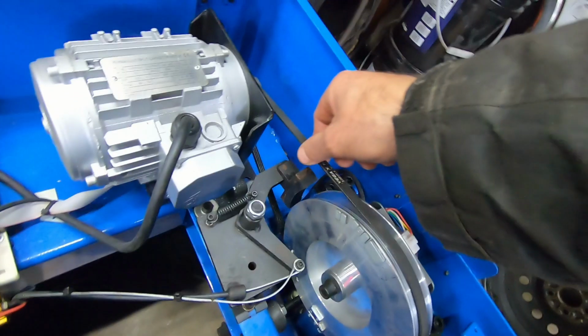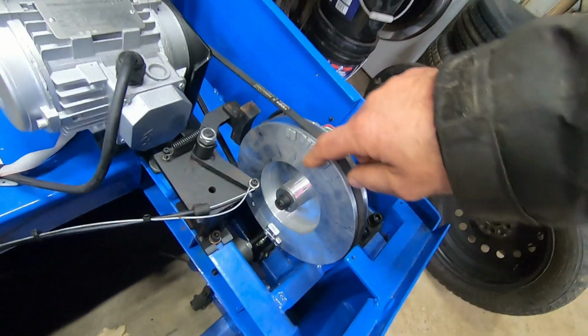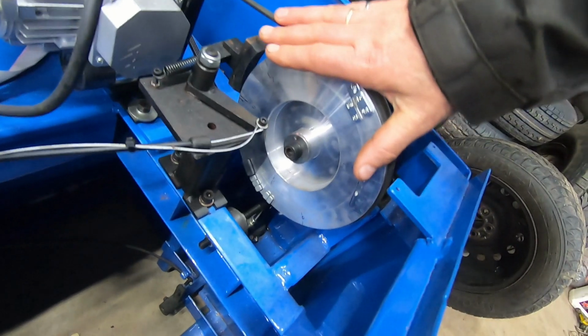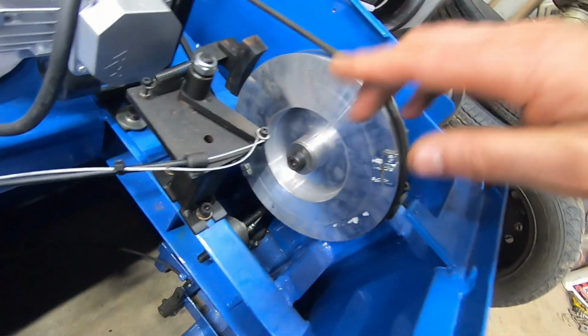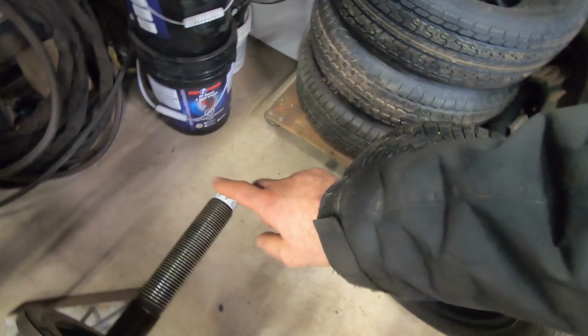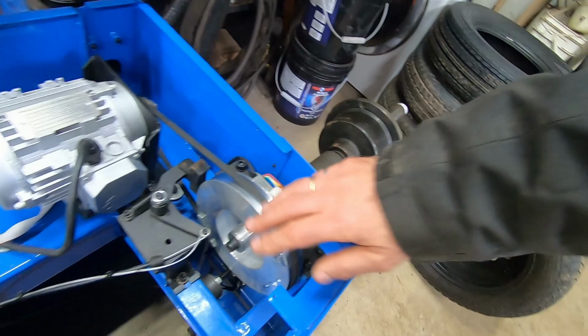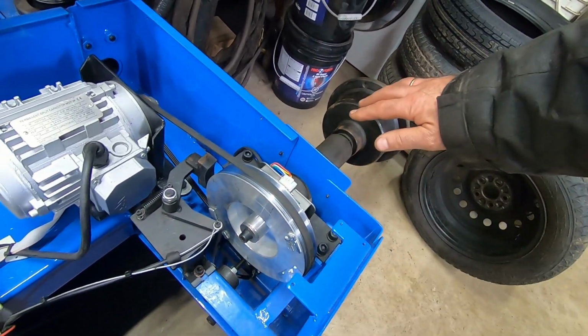When I took the belt off, I can take this belt off. As soon as I did, the pulley would roll down to one particular position and settle. It would roll and settle, always on that same position. And it was opposite the spot where the machine was telling me to add weight. So what did that mean? It meant the whole rotating assembly was not balanced.